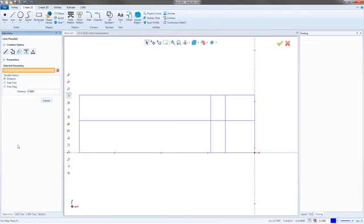Now the height of the groove, if you look on that drawing, it's 1.88 deep. So I'm just going to go dimension 1.88, or distance. Grab this line that I already created, and I just want to go down 1.88. Now, you'd never want to get rid of the bottom line or the face line until the end, because most of the time we're going to be using those for our parallel line. So I want to try and keep those there if I can.